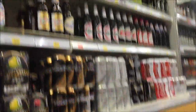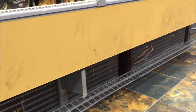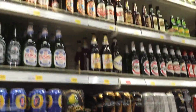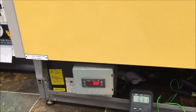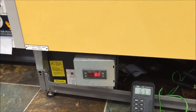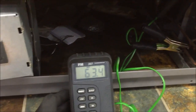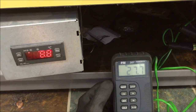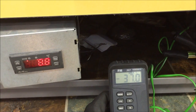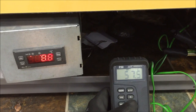Okay, so we're nearly done on this beer fridge. Cleaned both condensers — gave them a very good clean. I used two bottles of nitrogen to really get in there. They're looking good. I turned this on about 15 minutes ago and we're down to 8.8°C, so it's slowly coming down. Much better than earlier when it stalled at about 9.9°C and just didn't like it. The biggest thing though is the temperature for the coil — we've got about 63°C going into the coil and coming out we've got about 27°C. That's much better.